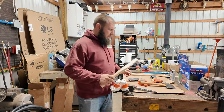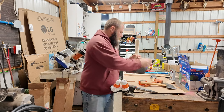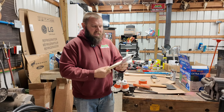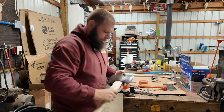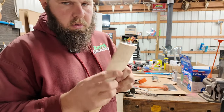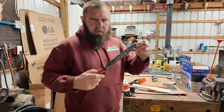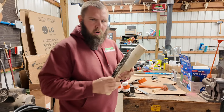Here's my handle, and I'm not an axe builder — I just do this for fun. I take a mallet and hit it down, and as it seats down it's going to leave a mark on the handle. Then I hammer it out. If you see, it makes marks on the handle. Then I use a Shinto rasp and just keep shaving where it makes the marks on the handle.